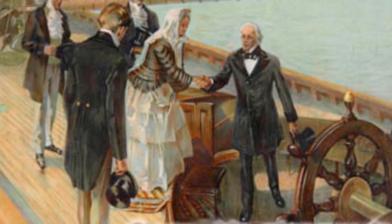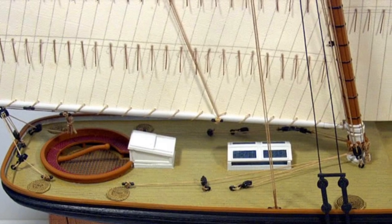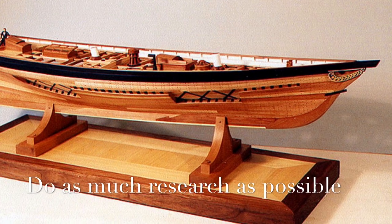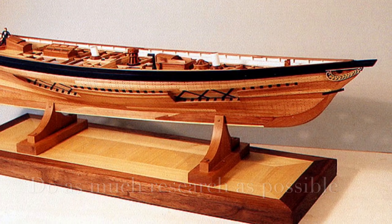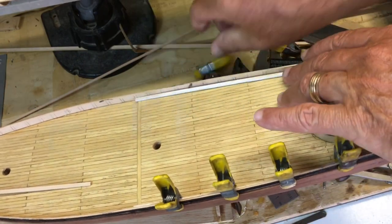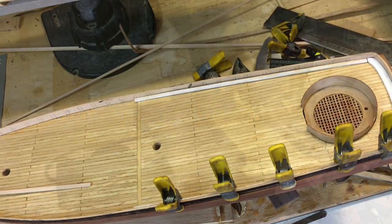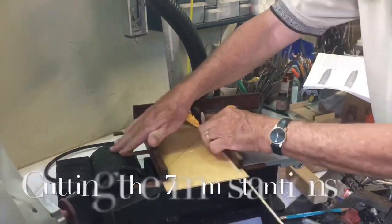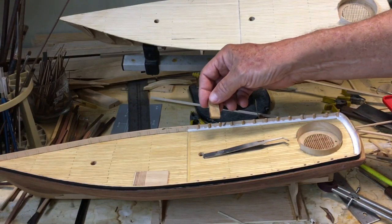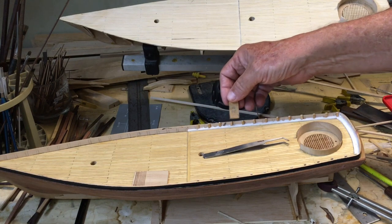These three photographs helped me establish where the color on the moulding starts and stops. At the end of the day, you have to make an educated decision as to where those lines are drawn. We just take it out now and see how well it's held the shape — and that's pretty good. So now we'll cut the stanchions on the table saw. We've made up a 14mm spacer to allow each stanchion to be placed in exactly the correct position.